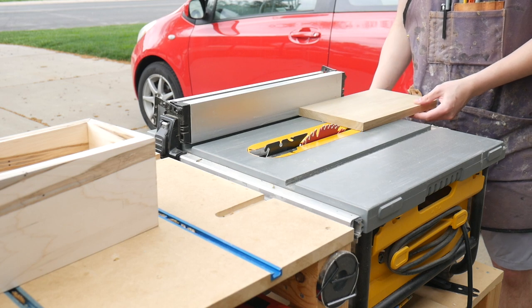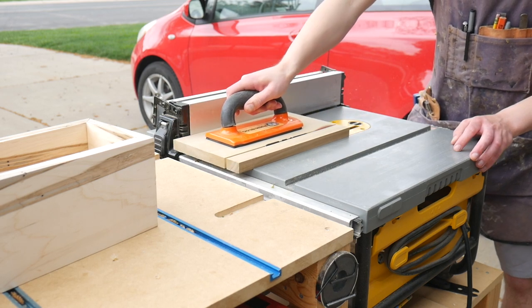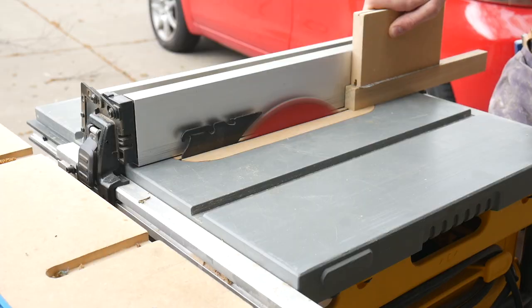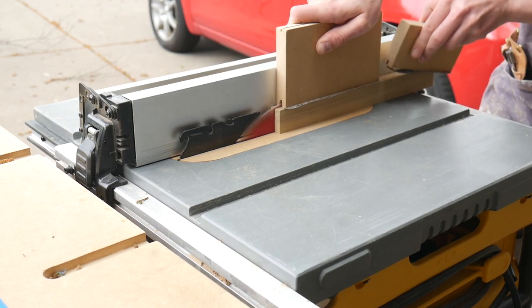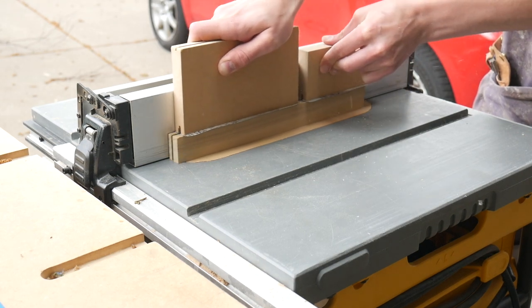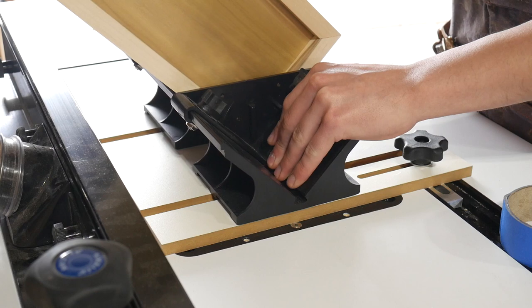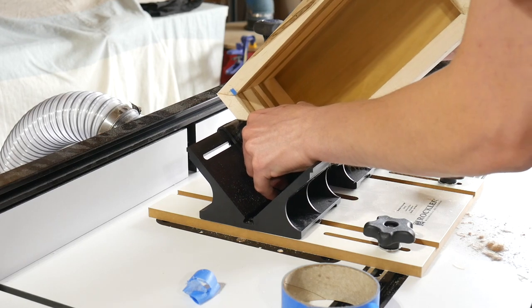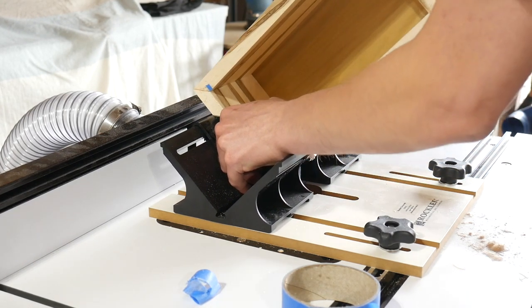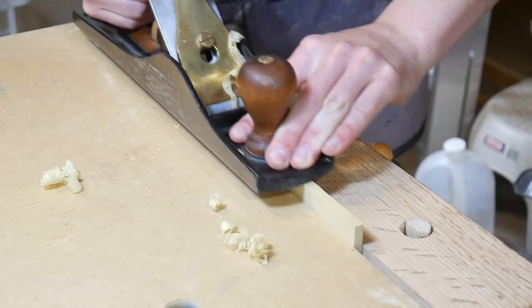While those were sitting and drying I could get working on the splines. I'm using that secondary wood — the same one I used for the box bottom — to cut some pieces for both the top and the spline material. I'm using the thin rip trick at the table saw to cut some thin pieces of quarter-inch stock for the splines, and this worked perfectly with no burning. I'm then using a spline jig to put in quarter-inch splines, doing two on each corner, and it worked out pretty well. It's scary cutting into a piece when you're this far into the project, but it turned out just fine.